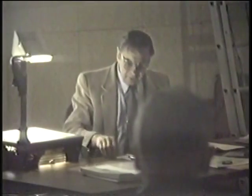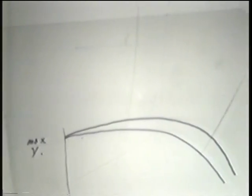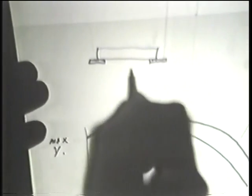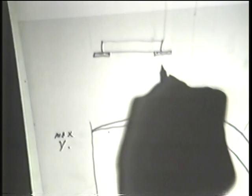Okay, I'm going to talk for a minute about that issue, because before you know it, you're going to be involved with this. It has to do with video 8. Now, we know what you're talking about, but a lot of the guys here don't. How can I best describe that? Head disc, head, okay? Slightly exaggerated. We know that the height of these heads on the drum is very critical, and it's not adjustable. The idea is to get the tape so that this tracks properly.